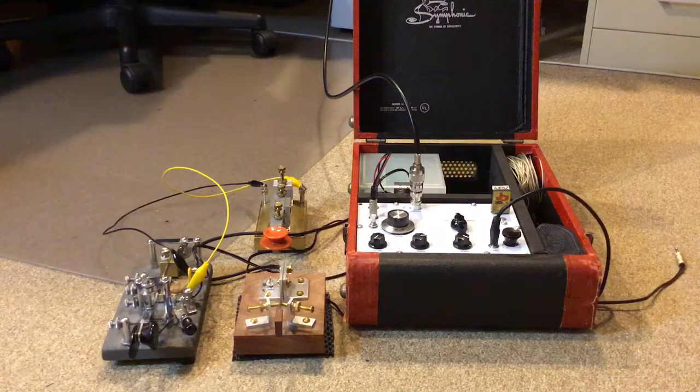It's got a regenerative receiver coupled along with a crystal controlled single channel transmitter in one case. It's got a very sensitive receiver, great sounding audio, and a very efficient Class E transmitter in it that draws very little current. I'm running it off of a AA battery pack right now, right out of the kit.